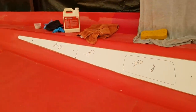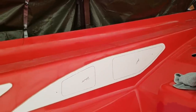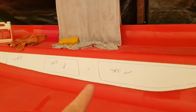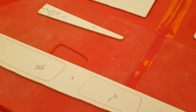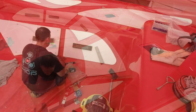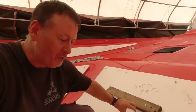I've finished all the smaller side window inserts — they're in, just screwed on and tacked in place so they're located, but I still need to bolt them from the outside. These are going to come off with the deck when it's demolded, so they've got to be pretty secure. I'm really only interested in the last 40-odd millimetres all the way around the outside — the rest is ultimately going to be cut out. The other ones I couldn't do on my own — they're simply too hard — but they're baton screwed on. These big ones I've got about a hundred bolts and nuts to put in place, but that's a major milestone getting these window inserts in.